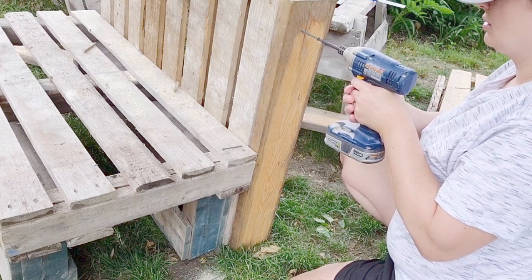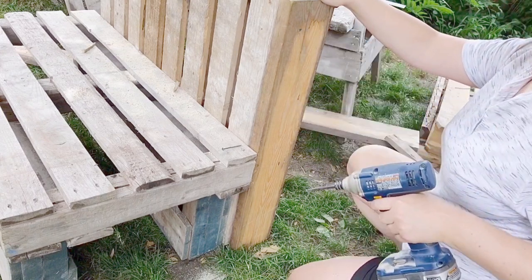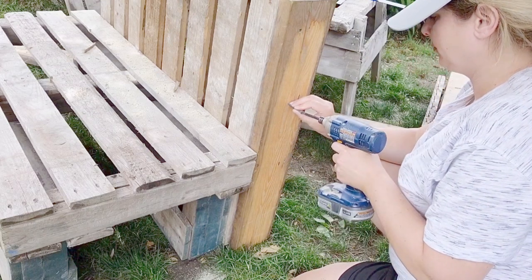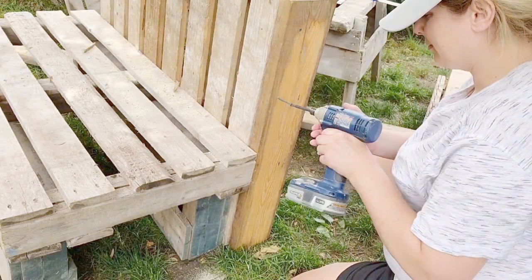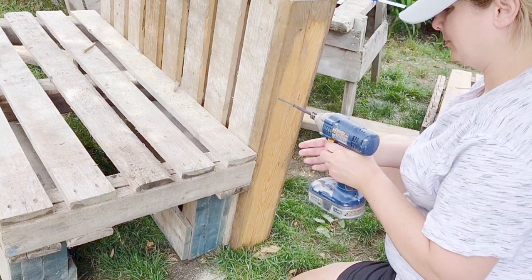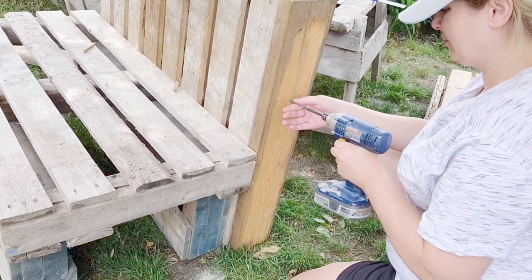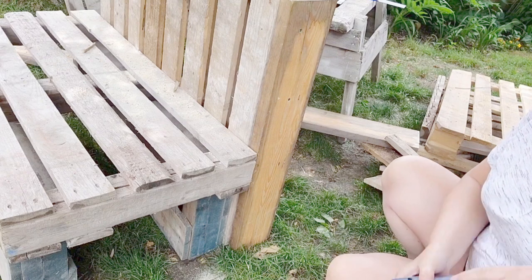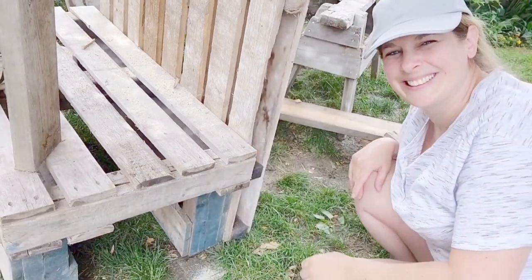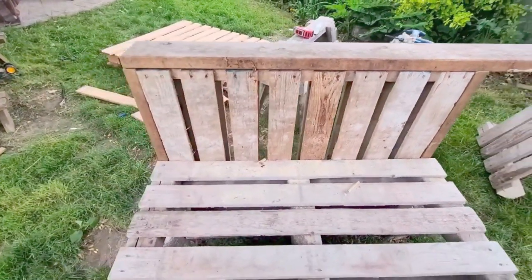We realized the hollow issue and I could see I desperately needed some guidance with the screw. Mr. Lovely showed me how to hold it properly and I eventually did get it. Here are the two pieces we're using for the side parts of the back — this is actually a piece of extra two-by-four we had, so you will need that other than the pallets. I'm measuring how tall we're going to have the two pieces on either side of the back. We cut it to have two pieces and screwed those into the boards. We did get it on and we actually added a top using the entire leftover piece of wood.